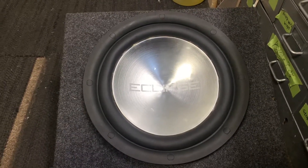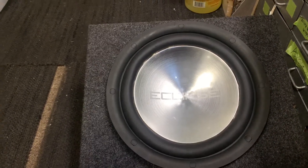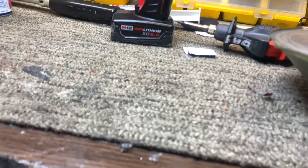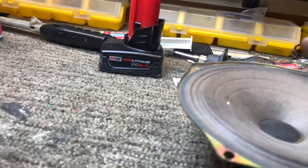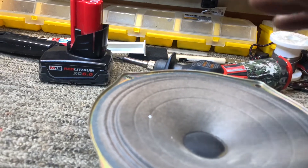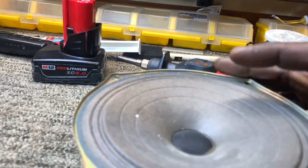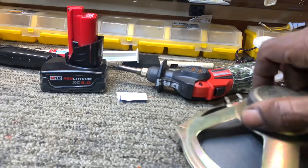Unfortunately I decided to make this video after I made the repair — I didn't really consider that it might be something other people might need to know. I'm going to use a little speaker that's just here on the bench to demonstrate. If you have a subwoofer that appears to have been blown or overpowered because it's not playing, and it turns out when you push on the cone it starts playing, most likely that's due to the tinsel leads.